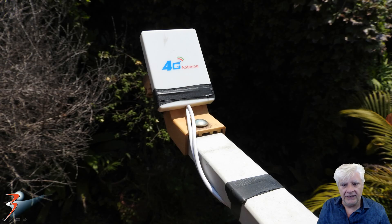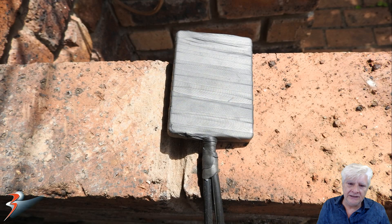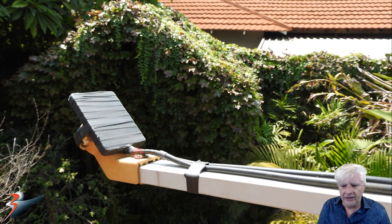I used it here as a proof of concept to see if I'd get a stronger signal. I took the cable that came with the router — 7 meters of RG174 — and inserted it into the outer sleeve of that coax just to give it some protection against the elements. Then I applied a single layer of self-fusing tape to the external antenna and sealed off where the cable enters the antenna to give it waterproofing and UV protection. I mounted it where I removed the LNB with a single wrapping of self-fusing tape and then strapped down the two coax cables to the arm.